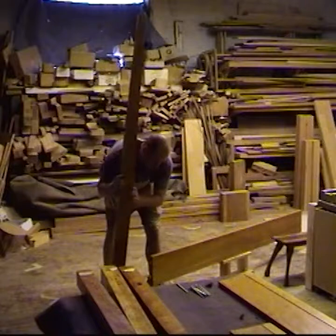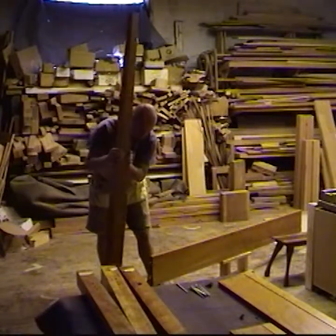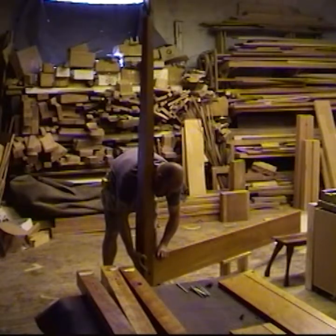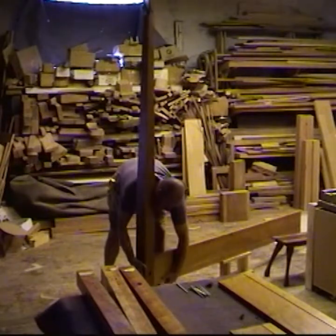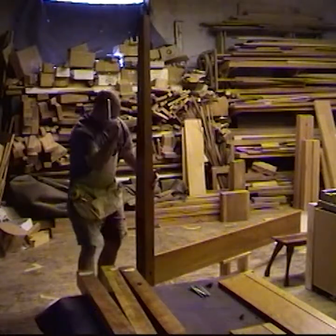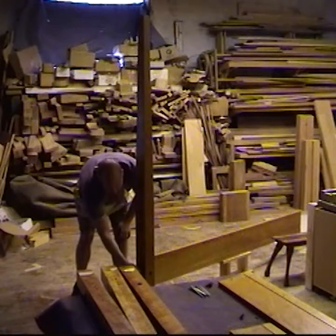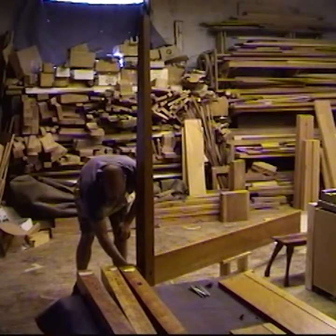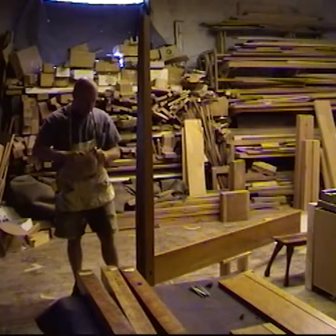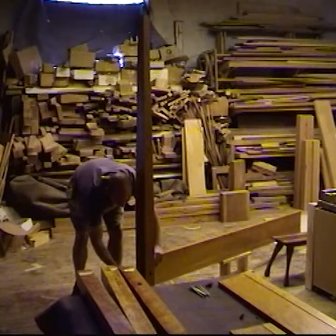So there are dowels at the ends of all the rails, and there are receiving holes on the posts. Just set the posts down, gently slide those dowels in, give it a little tap, grab one of your bolts, and it should catch. Tighten it by hand for a little bit till it's catching, and then snug it down with your 9/16 socket.